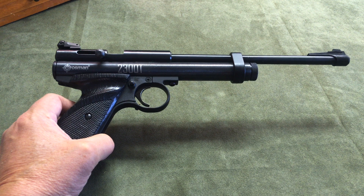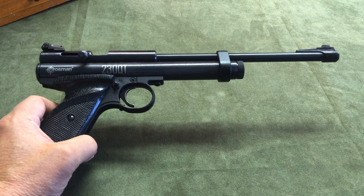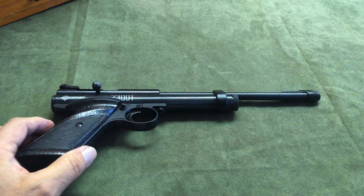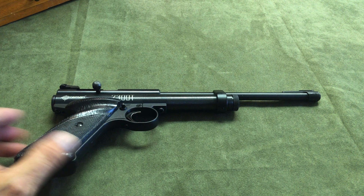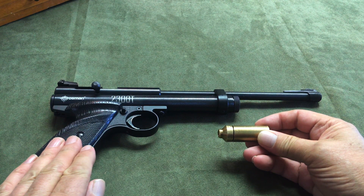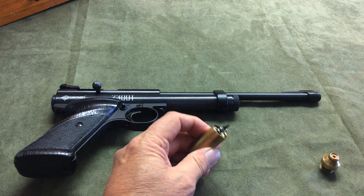When we talk about velocity, these are designed as target pistols where we're looking for consistent velocity but not extreme velocity. So another important thing, in addition to consistency, is shot count. And it's interesting what Crosman's done here to affect that. Crosman uses the same valve system in many of their CO2 products — all of the 2240, 2260, and 2300 series use a CO2 valve that looks like this. Where the 2300T and S are different is Crosman has added an additional part that reduces the overall volume of this valve.